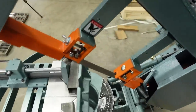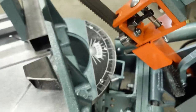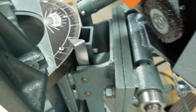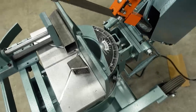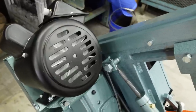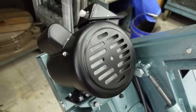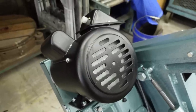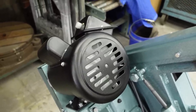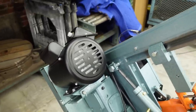Let's try a miter. One thing that's a bit odd is that the indicator is really high off the miter gauge, so it makes it hard to get a precise reading — I'll try to lower that. The motor is also doing some weird stuff on startup: it doesn't start smoothly until it gets going. It feels like an issue with the starting capacitor. But once you've started it recently, it doesn't do that anymore. I'm wondering if that'll just smooth out over time.